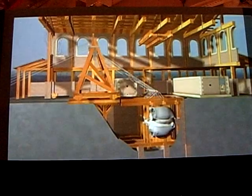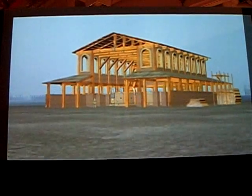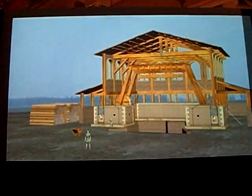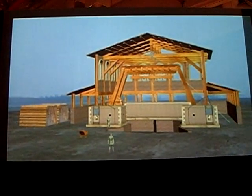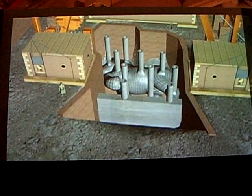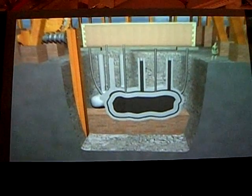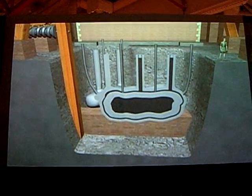While the reinforcement operations begin, the molds of the legs and the head are also assembled. The closure and interment of the mold requires perfect organization. Some workers are assigned to fill in the core, others to positioning the casting ducts, vents, and pyrotechnic sensors. Still others, after having covered the entire mold with a layer of plaster, begin to fill in the pit.